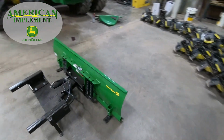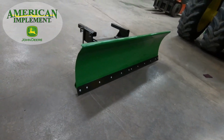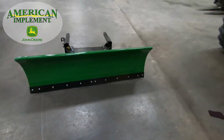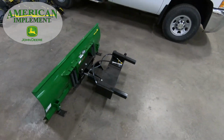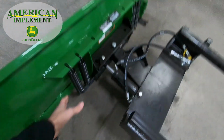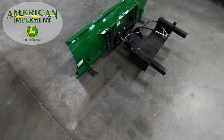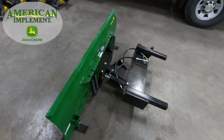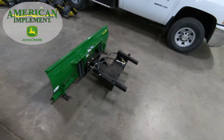or you can get one of these front angling blades that's designed to actually flip over material instead of pushing it, so that you can push more and using less of your horsepower. This is one of the simpler attachments you can get for the 1585, but it's probably one of the most used. It also has springs designed to, if you hit a rock or a hard surface with the front blade, it'll actually just take all the tension with the springs instead of damaging the blade or stopping the tractor.